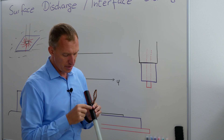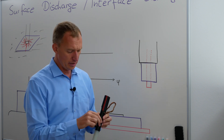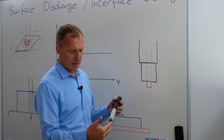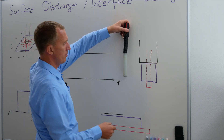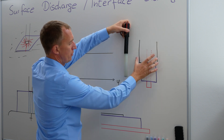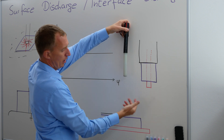There's another semi-conductive layer in there, but let's not overcomplicate things here. And at this very point I'm getting a setup again which looks like a setup for a surface discharge. The outer part here is my semi-conductive layer, this would be my XLPE, and obviously I have a conductor inside here. It doesn't stick out here, but this is usually the case.